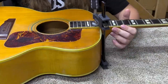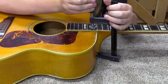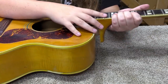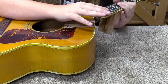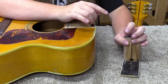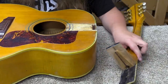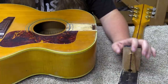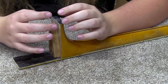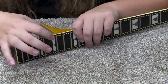I didn't have to take a whole lot off of there — just trying to keep it all straight. The one thing I need to do now is make sure the dovetail is fitting tight. I wouldn't be surprised if that wasn't initially an issue causing it to come loose. So I'm going to make some paper-thin wooden shims to put on each side of the dovetail to make sure it fits in there as tight as it can. As you remove material from the heel, that pushes the dovetail forward, which loosens it — so we need to add material back to the dovetail.